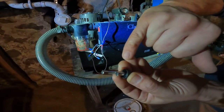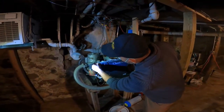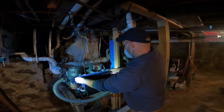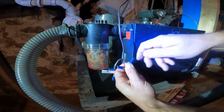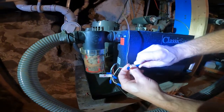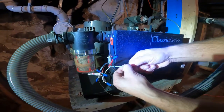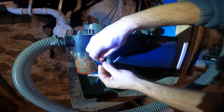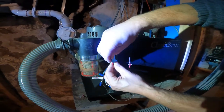There's a fuse, and we can see it — it's not blown. These higher amperage fuses, it's easier to tell if there's a problem with them. So those back on — we're going to disconnect these two wire nuts with the system off. This is just low voltage, 24 volts. We'll unscrew that, and then we'll unscrew this, and we will buddy those up together. All the reds were put together, and then the white and the blues were put together — that's how that was.